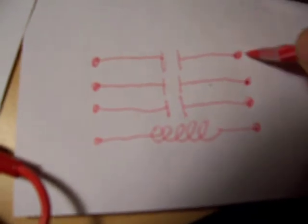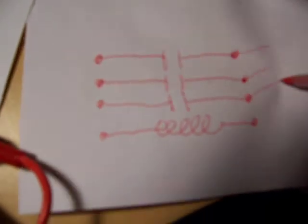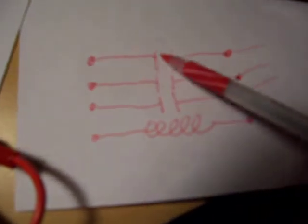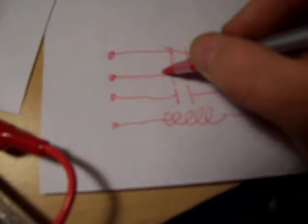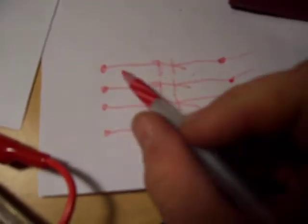You see in my picture, you have these normally open contacts and then you usually have line voltage going here, so the line voltage can't close until that coil energizes. When that coil energizes, you have it closing letting power go through the other side.